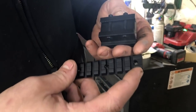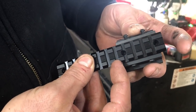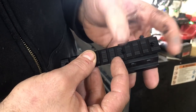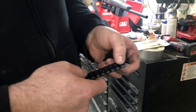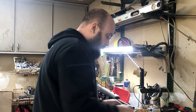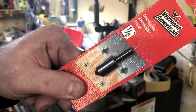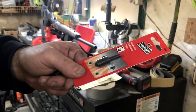This is the piece that comes with the Predator Tactics. The two screw holes are already there. When we cut this off right here it's going to be perfect — these grooves line up perfectly. It's going to give us enough for two guns, 10 bucks, can't beat it. We're going to step up the size of the hole, and we got all our hardware at Ace Hardware. Then we're using a half-inch countersink to put the taper in to set our screw down so it doesn't interfere.